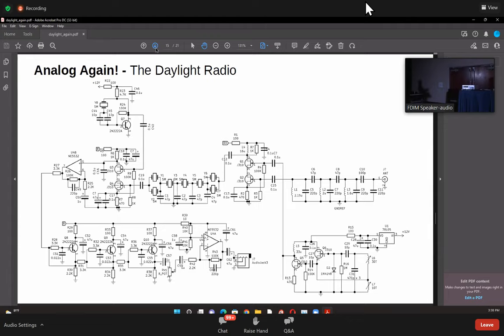Okay, we start with the 50 ohm antenna. The other side of the bandpass filter is 1K. The output of the mixer here is again 1K, right? Because your filter also has a characteristic impedance of 1K, directly followed by the detector. There is no IF amplifier, there are no RF amplifiers, because both the mixers themselves have gain. And in spite of having gain, in spite of being active mixers, they are very resilient to overloading. They are extremely good mixers.